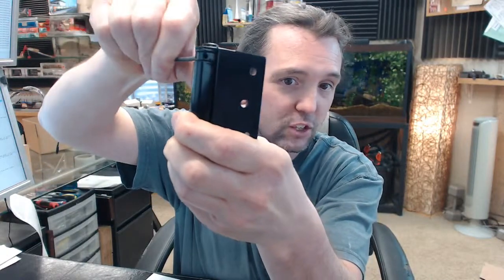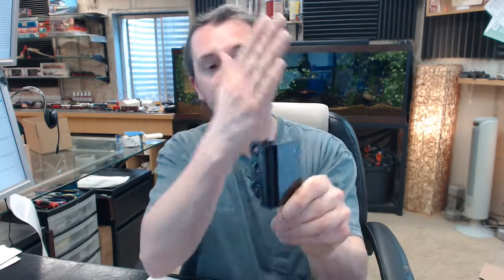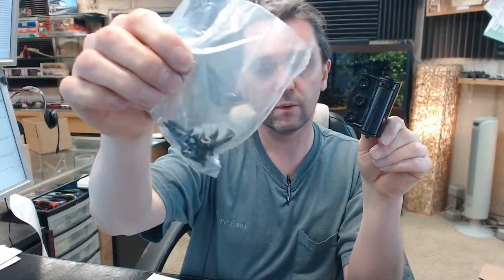Setting the tension: when the tension collar is pointed up, you would insert a tension rod down near the shoulder into one of the holes and turn it clockwise. When you turn it clockwise, you reveal new additional holes, and it is into one of those new holes that you insert the tension pin that is included — that will keep tension on the spring hinge. You might get your hinges installed onto the frame first, get that centered where you need it to be, bring your door in, shim the door all the way around to the proper position, whatever the margin is at the head and the jambs, and then attach your screws — which are included — to the door.